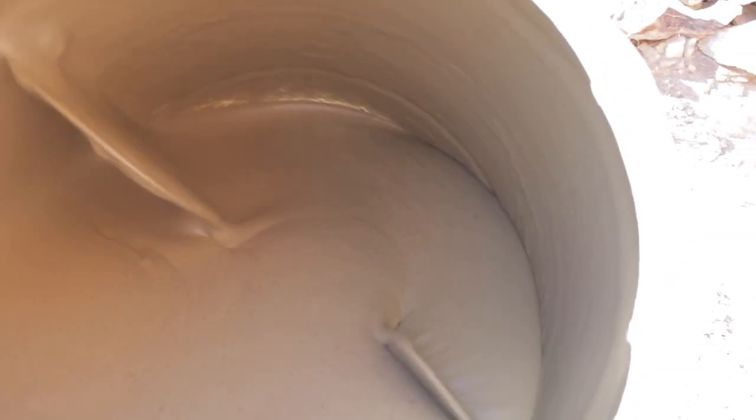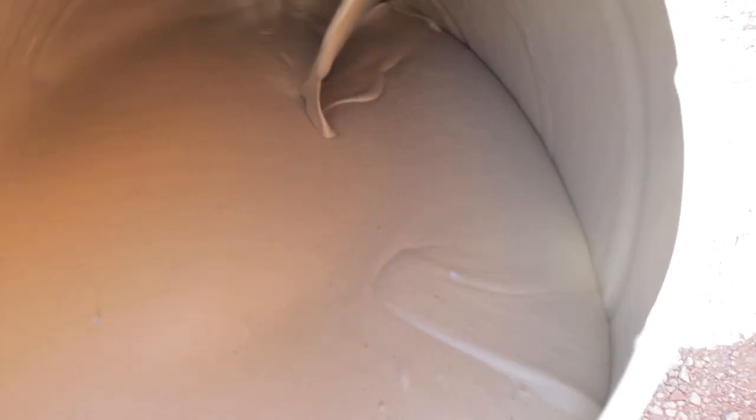You can see now the way the AirCrete's mixing with the new bigger paddles — it's doing an amazing job. If you look at the first batch from the day before, the AirCrete just wasn't mixing: the foam was staying on top and the Portland cement was staying at the bottom. They just didn't want to mix together because the paddles were too small. Now it's mixing nice and uniform — a nice creamy mix, which is what you want to see. Almost like a milkshake. You don't want to see big bubbles rising up to the surface.